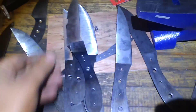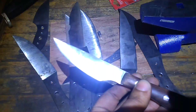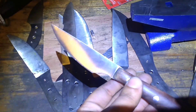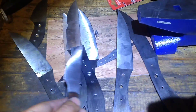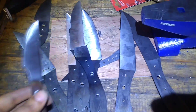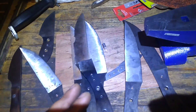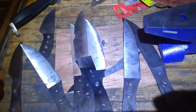With this blade here — this is 52100 — you can see what more alloying does to increase strength. This is about 10 thousandths and it will actually hold that 10 thou geometry. Is that to say 8670 can't? Well, no — maybe there's some quirk with the heat treat yet to be discovered. That's kind of what we're doing here: exploring the metallurgy, seeing the limits. I definitely need more equipment, more resources, and more time to do all this stuff.